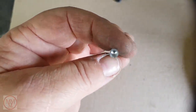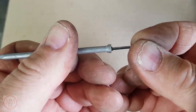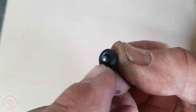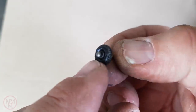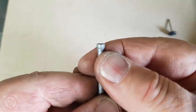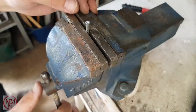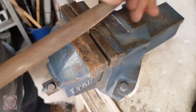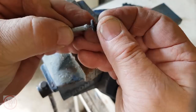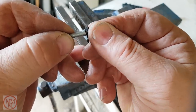Here is my attempt at a 1mm deep cut. Nothing ever goes as planned and it's actually slightly too deep as you can see. Now if it's too deep, when you use it, you run the risk of the tool rubbing against the tire and melting or scuffing it up badly. Therefore, I've got to take a little bit off the top here to make the cup shallower. So I'll do that now — again with the file. After double-checking, this time there is just a very small clearance between the end of the tool and the tire, and that's exactly what you need.